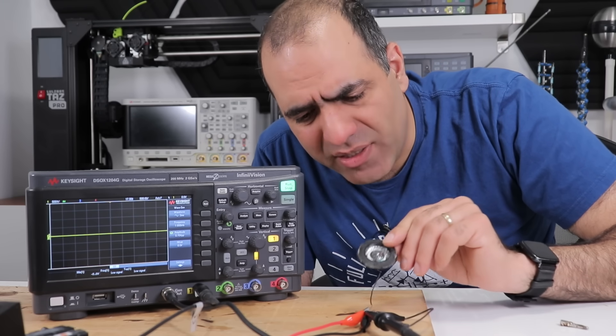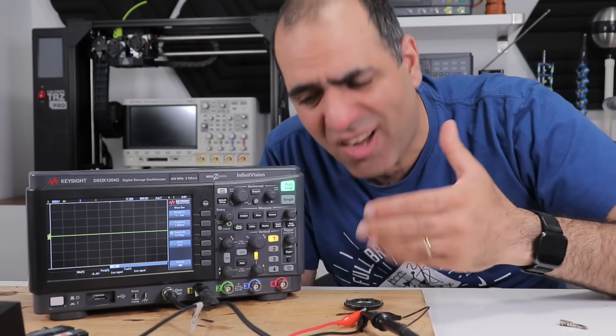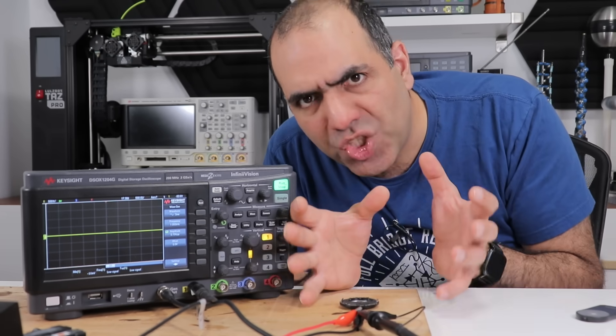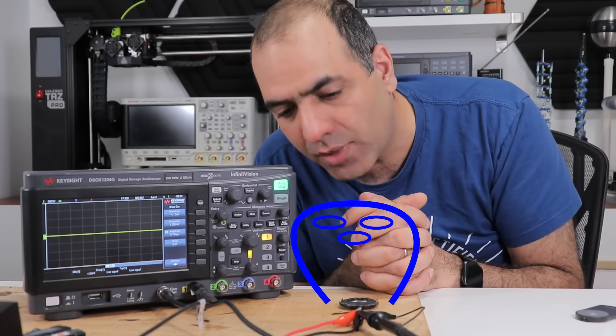Here is the speaker. Headset speakers don't output much audio though — they are not made to yell. I connected it to my function generator at 1 volt amplitude, which is the maximum these guys should take. It sounds weak, like when you stub your toe. The main reason for the weakness is that this speaker doesn't have an acoustic chamber. An acoustic chamber is basically a cavity in front of the speaker with some holes that the sound comes out of. All audio products must have it. What an acoustic chamber does is provide some impedance matching — basically helping to pair the very hard surface of the speaker diaphragm to the very soft surrounding air.